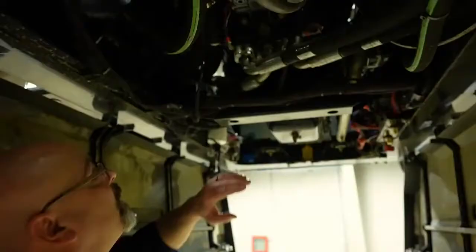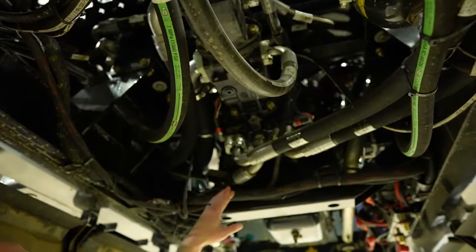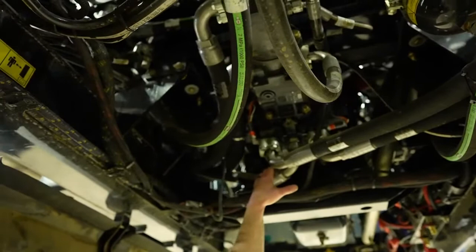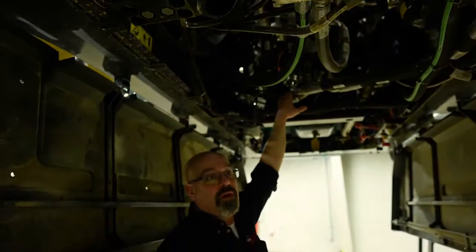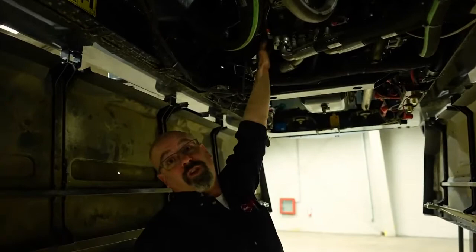With the ground drive of the sprayer, we have the new planetary systems with variable displacement. On these newer smaller models, we have only one hydro pump because every motor has individual traction control and RPM sensors — we use the variable speed to control the traction and oil flow direction. With this one hydro pump, we of course have one hydro charge filter. In my opinion, it is best to change that filter every year and especially after the first 50 or 100 hours of operation.